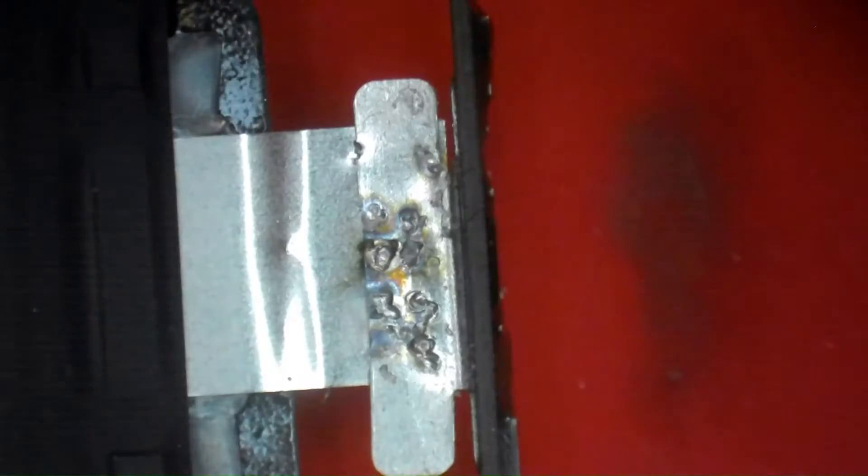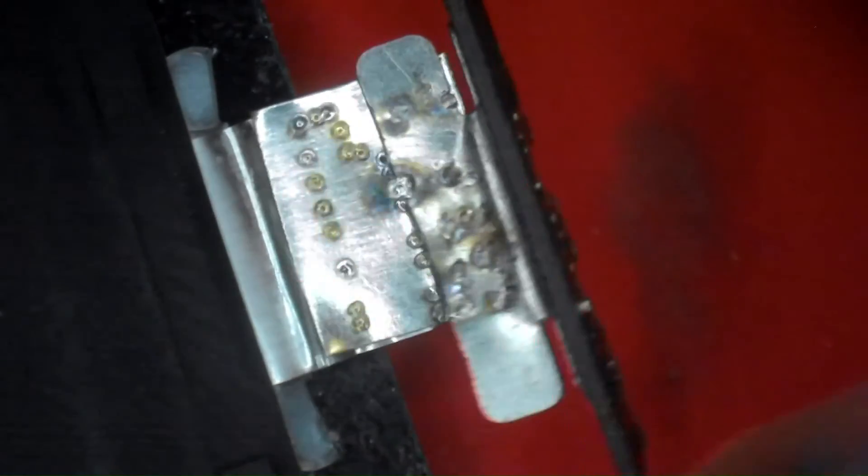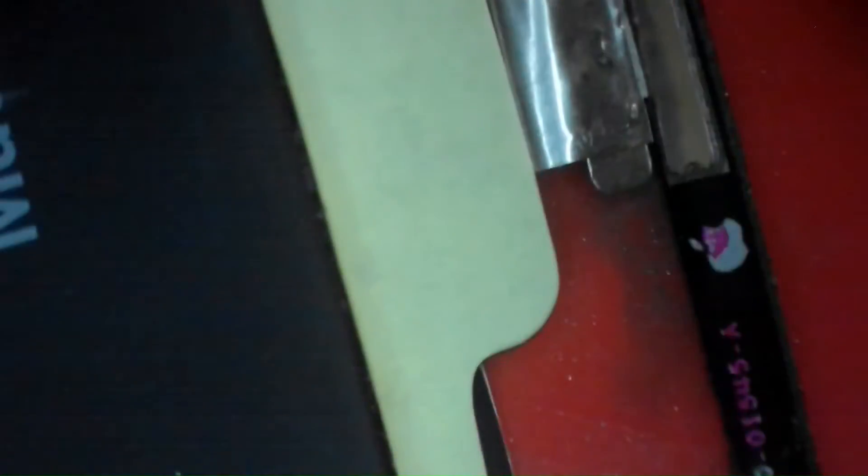A few other content creators like Brady have also made helpful videos on this — check those out. Now that both tabs are welded, do a pull test on both leads. If we find some weak welds, open that up and come from the inside without the jig to add a couple of welds to tack it down and make it secure. Do another pull test on both sides to confirm there are no loose welds. Don't move forward until the pull test confirms your welds are secure.